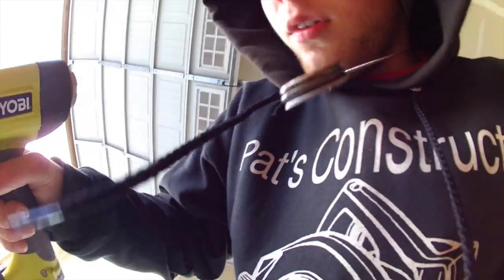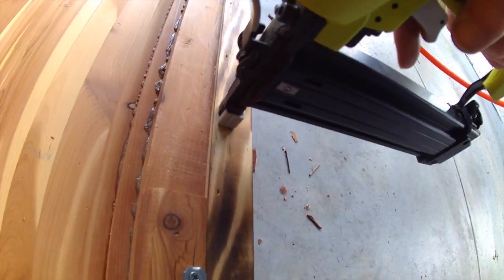I'm not gonna use the 1 1/4. I think she's fine. I do say that I think there's plenty of brads in her. Just need one more here. And then she should be good to really just make sure she stays down there. Now to just fill that up with some wood filler. Get some wood filler. Because that somehow, it always happens to me.